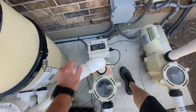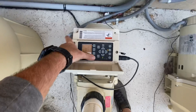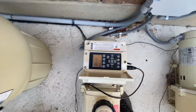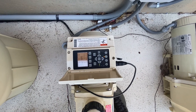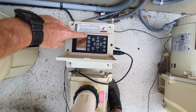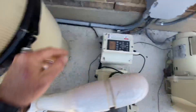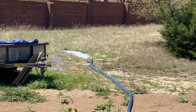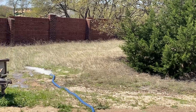It's probably from the landscaping and all the dust and wind we've been getting back here. The system's gonna be a lot happier and that high pressure limit should go away. That's been about 20 seconds — give it another rinse. Let's get to zero, then number four for about five seconds. That was two backwash cycles. I'm gonna do another quick one just to be on the safe side — I know this thing was really dirty. Looks like we got most of it out; it's just barely coming out dirty.